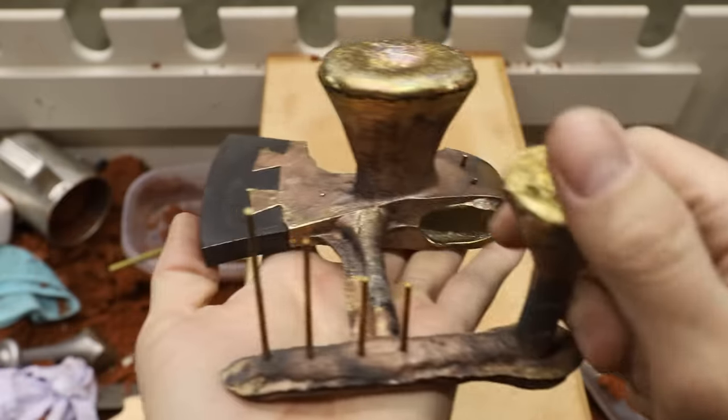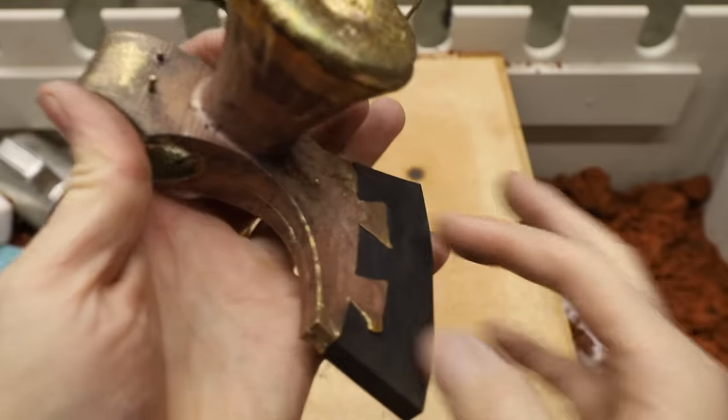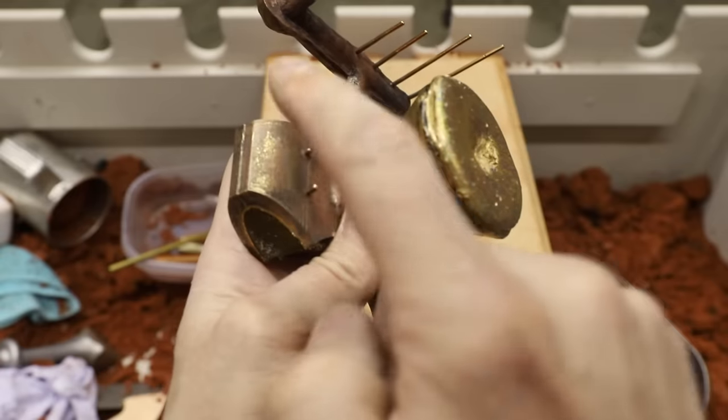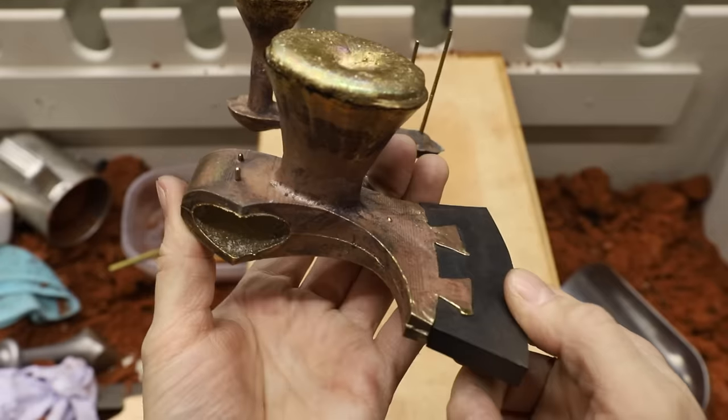In order to fix that I'm going to tilt it this way, and that's going to force the metal into these little crevices as quickly as possible with as much pressure as possible. So it's going to fill up this way. Hopefully there's no problems up here with it solidifying before it gets to the top of the axe, but we'll fix that if that's a problem.